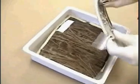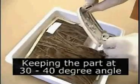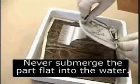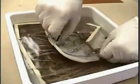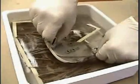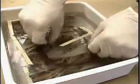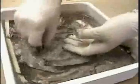Begin to process your part by starting at one end and keeping the part at a 30 to 40 degree angle. Attempt to keep the same angle until the complete part has been submerged. You are attempting to enter the water in a way so that you are not trapping air bubbles under the part. You want to dip the part with a smooth, even motion, pushing your part down and towards the ink.